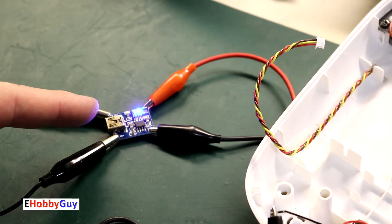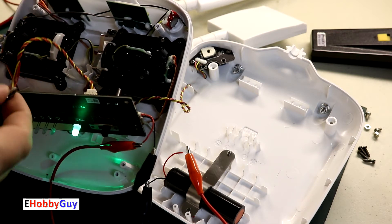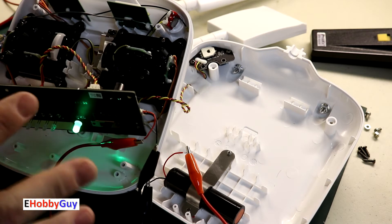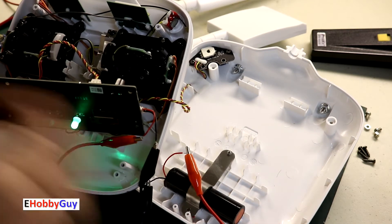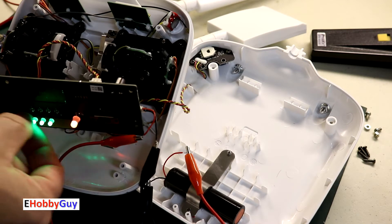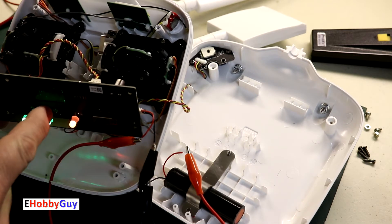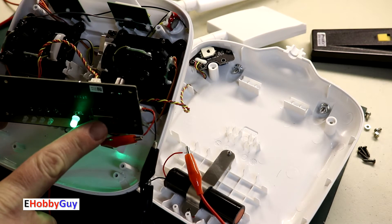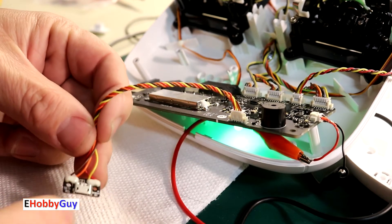The battery is now fully charged — the red LED went out and the blue LED came on. I hooked the battery back up to where it should be and plugged everything in; the only thing disconnected is the original charger circuit, which is going through this board somehow. I still have the green LED problem because I haven't done anything to resolve that. But what I wanted to confirm was the charge indicator when I switch to the on position — yes, the battery has a full charge and all four LEDs are on. I can use this module to charge the battery and get a charge indication.